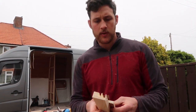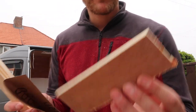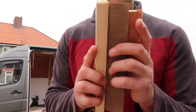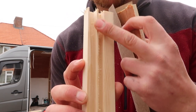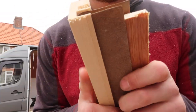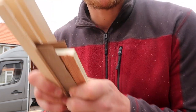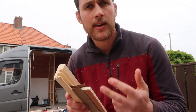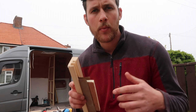Just a quick tip — you want these tracks to run as smooth as possible. I've got a piece of 9mm offcut ply with sandpaper wrapped around it. Be careful when you insert it into the slot because you don't want to snap the thin bar in the middle, but it sits in quite snugly. Just give the inside of your tracks a good sand — this will make sure the doors run nice and smooth when they're sitting inside.